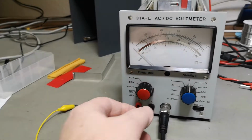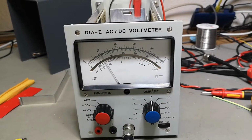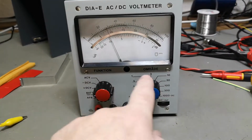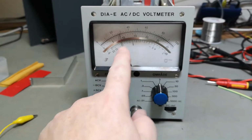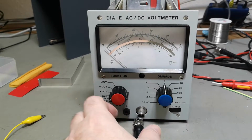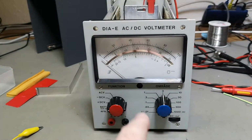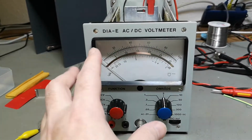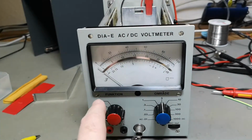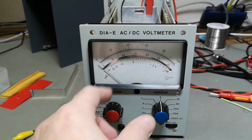Let's try and go positive. And let's try a DC offset about... Yes, that is 1 volt input. 1 volt DC input. We are 3. Yes. That is interesting. So, if I can fix the DC offset problem, the unit will work. So that means all the transistors and amplifiers and fancy stuff is definitely working. There is a leaky capacitor or something.